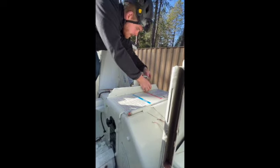So to recap, Hunter, that's the most common cause of no start? Correct. That little plug, if something's out or someone forgets to plug that in after changing knives, the machine's not going to start. That's the first thing we would like you to check. There's no locking pin for this, nothing locking it in. There's a little latch holding it back, but nothing major.